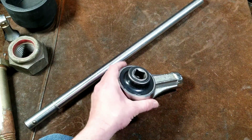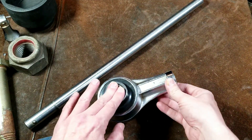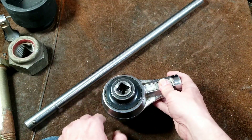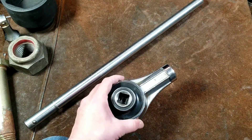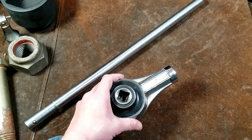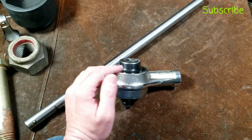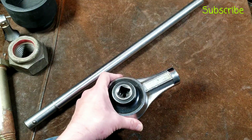That gives it versatility. Since it's a gearbox, when you're turning the input, the casing moves in the opposite direction with twice as much force as the input — the output is 4 times, but the casing reaction is twice. That gets real dangerous. You can almost never brace it against your body, because if you're using a torque multiplier it's already a huge stubborn fastener. These need to be braced against something very solid.